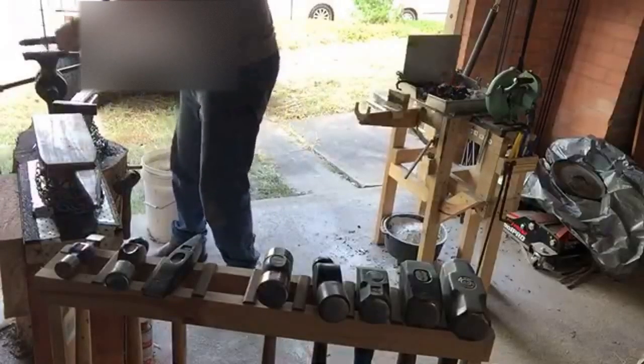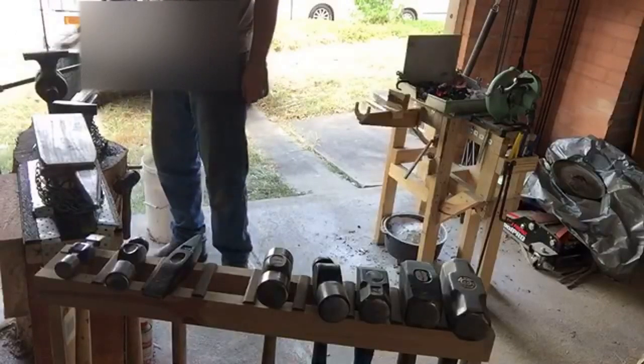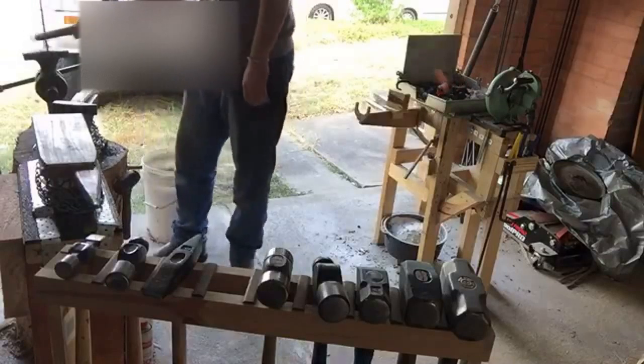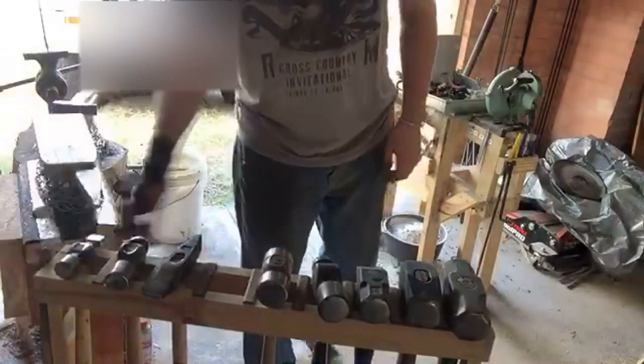After doing a twist, you always want to immediately brush it really heavily. Yeah. Because, I mean, you saw how much schmutz builds up on the outside of it. If you then let that cool on the surface, it makes for a messy twist, and it's just impossible to get clean. So you do it while it's still hot. These are just $7 at Bunnings, by the way. Hell yeah. Yeah.